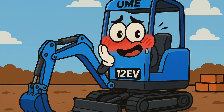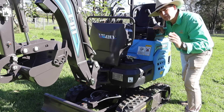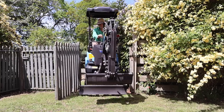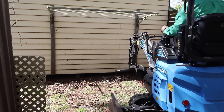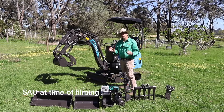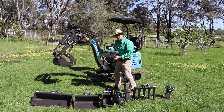Underneath the sexy bodywork is a 17.5 kilowatt hour battery powering a 4 kilowatt motor that puts out 23 newton metres of torque. All that battery power is spinning a hydraulic motor that puts out 22 litres a minute of flow at 16 MPa pressure. The narrowest track width is 800 mil, meaning it will go through most residential gateways without a problem. The dozer blade lifts to 145 mil and digs to 200 mil. It's got a three metre digging radius and a maximum digging depth of just over 1,750 mil. When you buy this thing for just under 24 grand, you get seven different earth moving and digging attachments, a really high quality 15 amp charger, and a complete tool kit including a grease gun.